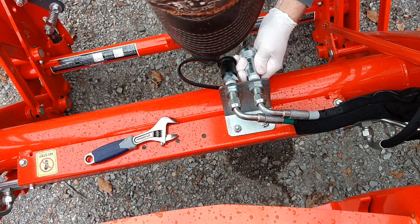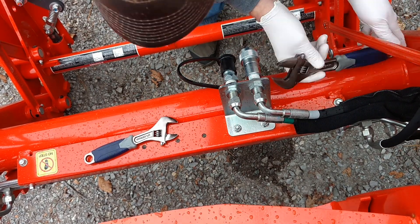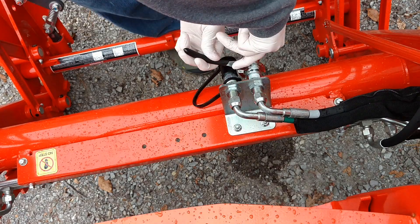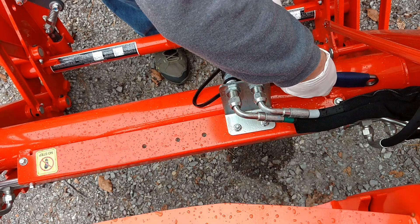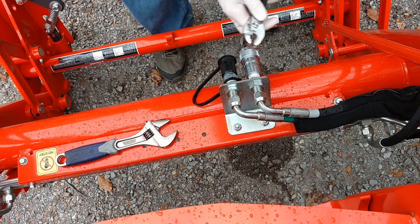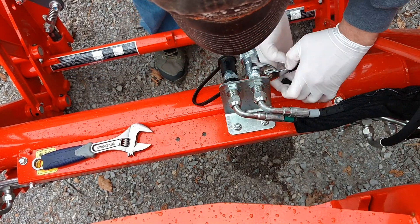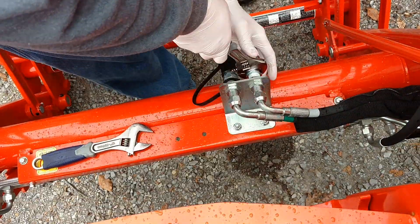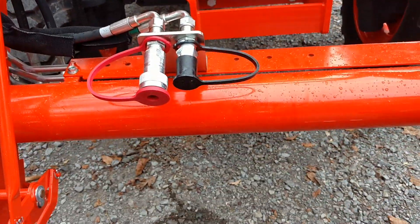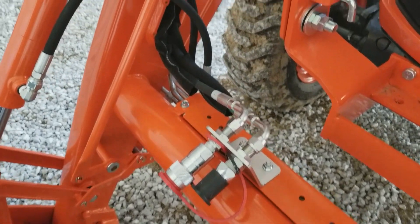Here I learned I really should have put this fitting on first. I didn't have the right tools to work in this position, so I'm moving a wrench around hitting the loader arm and the bucket level indicator rod. If you do this again, do the right-hand side of the tractor first, then the left - it made life a whole lot easier. I was able to get a pair of pliers and work everything out. Here's the finished install - I noticed I forgot to put the cover on the female red fitting, so I did have to squeeze that on after.